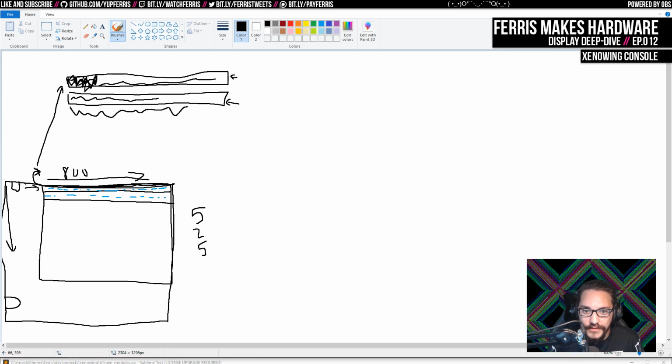So essentially what we do is we have a pulse, which happens around here. And it happens every 2 lines, which actually I think it happens here. That's when the pulses are done. And as soon as that pulse happens, we swap which buffer that we use. So the buffer select inverts. And then we also fire off a begin signal for the load issue and load return.